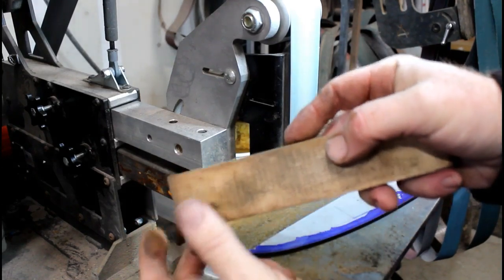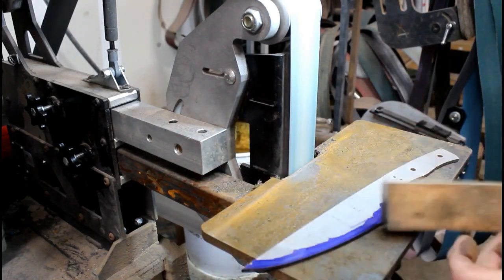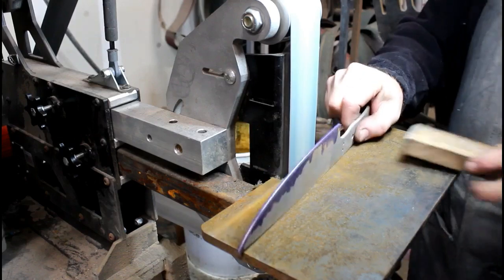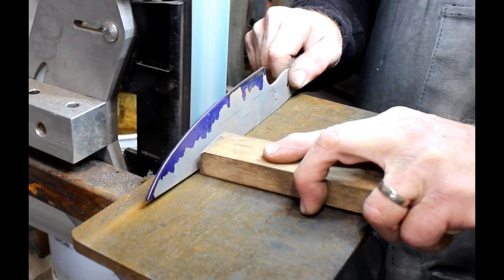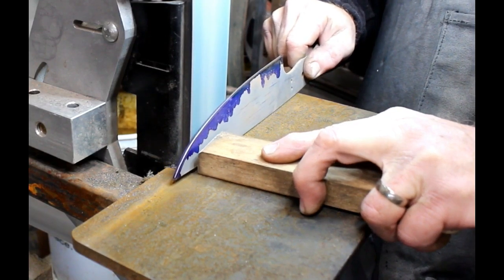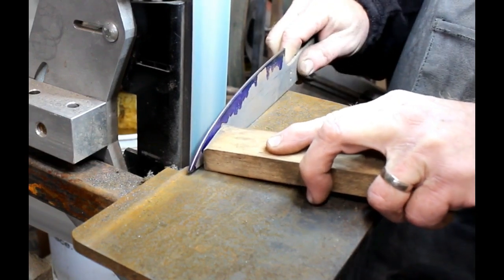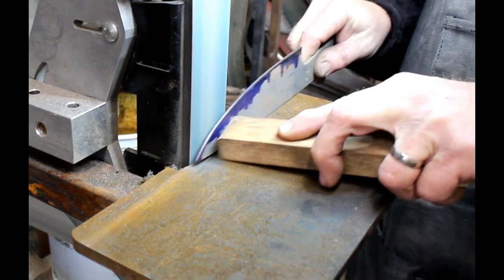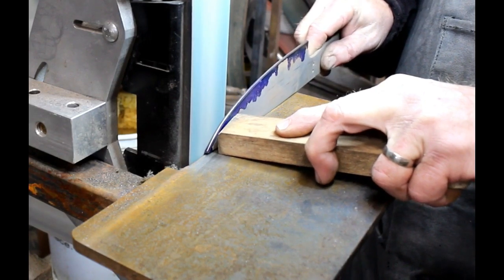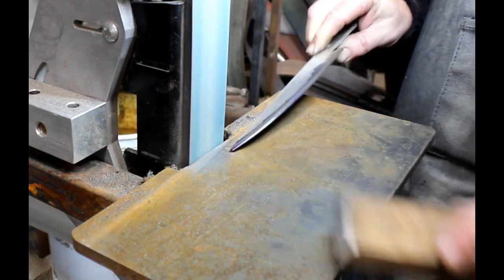This is a push stick that I use, and I've curved the back corner just so it doesn't jam into my palm. The leading edge is actually angled forward a little bit — you'll see in a bit how I'll use that to press in on the edge of the blade rather than the bottom. I'm going to start by just breaking the edge of the bevel — just breaking that hard 90 degree edge. I'm using a 2x72 belt grinder, this is an Origin blade maker, 2 horsepower, variable speed. I'm using a 36 grit belt to remove the majority of the material.